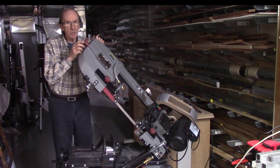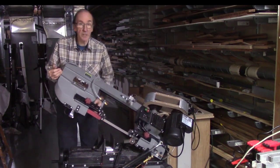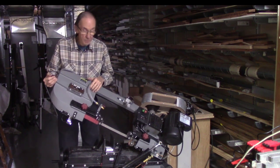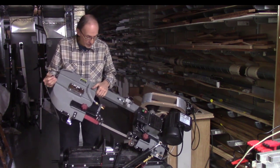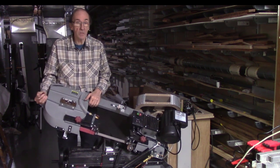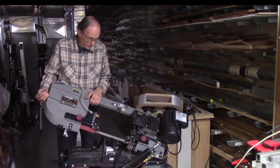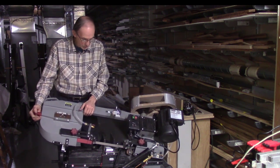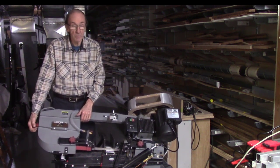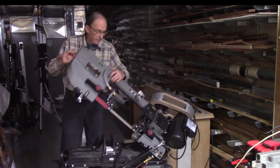I said it can be used as long as your bandsaw blade is, you know, 8 or 10 inches above your work surface. You can use it for setup. And in my shop, that will work quite nicely because I normally move my blade up and down, 8 or 10 inches for the piece of the material I'm cutting. So I can use it for initial setup and alignment. It's just that as it gets down close to the work surface, you lose your projection, with the exception of the side. You do get a side projection.